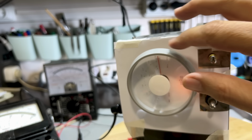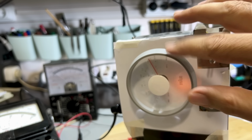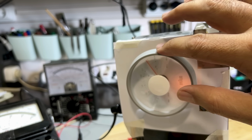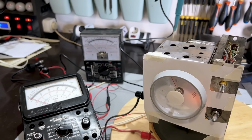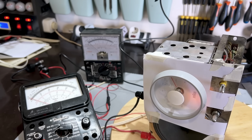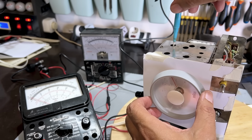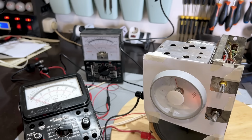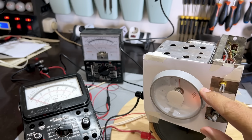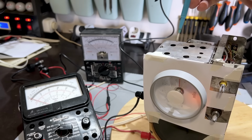Set the absolute right, not there. Where is it? Oh boy. This thing is picking up at about 91. So I believe it's that one and that one. I'm not sure which is the front end and which is the oscillator, so I'm going to just try it. Oh, that's definitely the oscillator. So I'm going to move it closer. Actually, now I can just put it on 88.5. 90. So 88.5 is the absolute right.